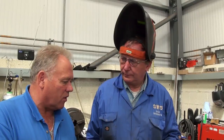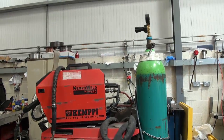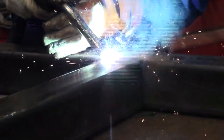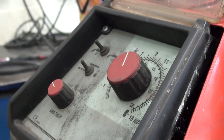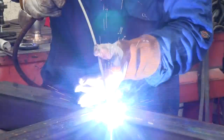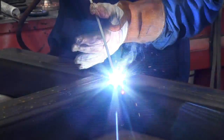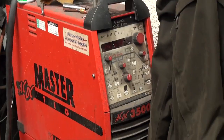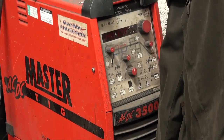So Ivor, the current that drives these two forms of arc welding — where does that come from, how does that work? Well this one, the MIG or MAG as commonly known, the power comes up through the bench and burns the wire that makes contact. Manual metal arc — the current can come either way because you've got DC positive or DC negative, where the current flows through the bench or through the actual work itself. So you complete the circuit really by one way or the other. Or you can go on to AC, which is what you get with a DIY set — it's plugged into the mains — and that's just AC current, which does exactly the same job as the DC. Except DC welding makes the rods run a lot smoother, as you noticed with that.